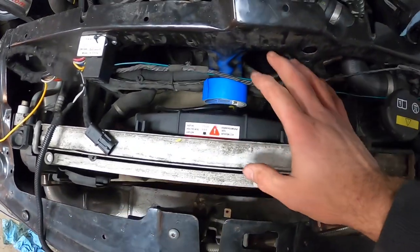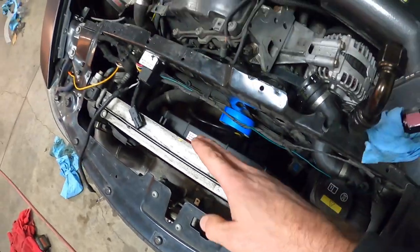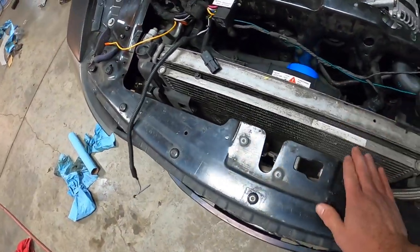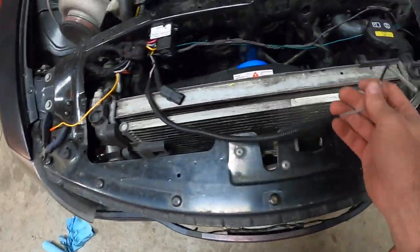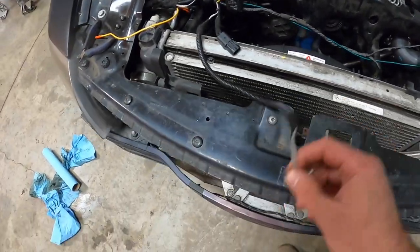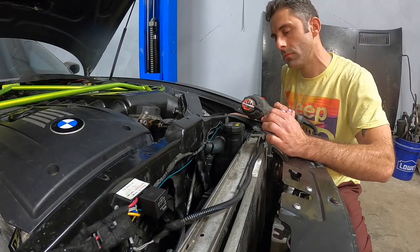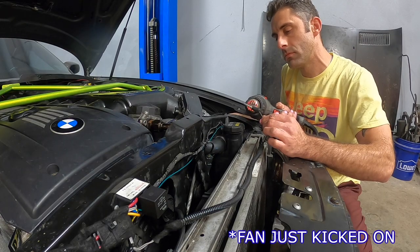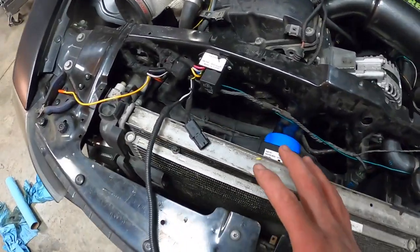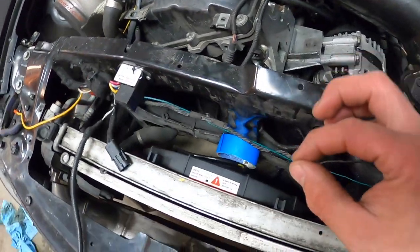Taking a look inside the engine bay, there is a 16-inch fan installed — it's basically a puller fan that pulls the air in. It operates off of a temperature sensor that sticks inside of the radiator core, which is fine. When I was testing the car, it turned on and off as it should have. The fan controls are not the issue — it operates by relay and it's hooked up to switch power.